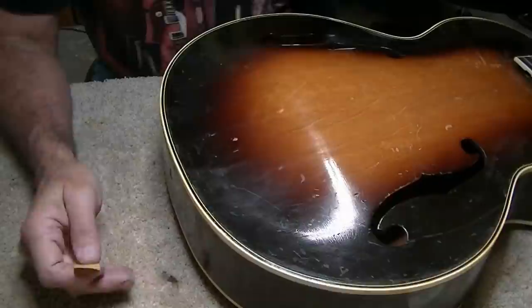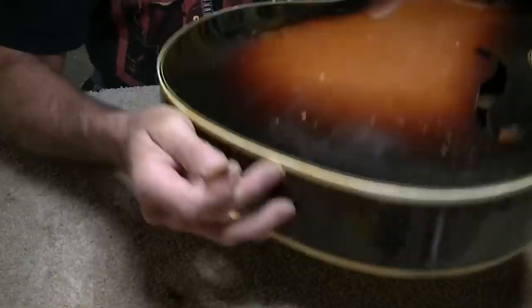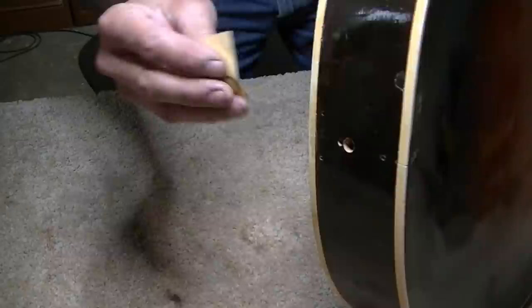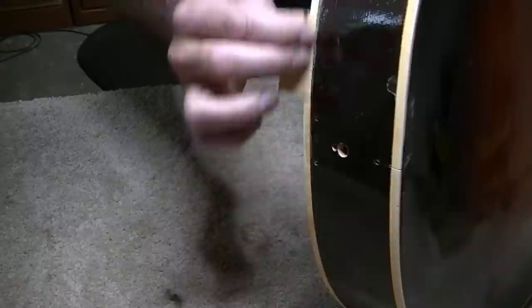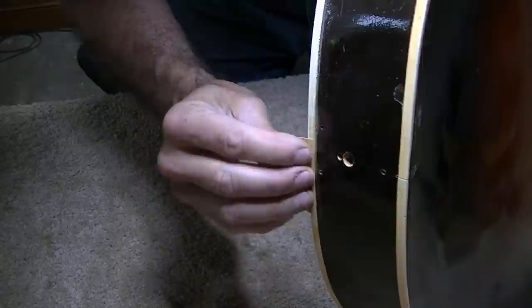It's starting to look better already. As you go through these processes sometimes you find you're close but haven't hit the nail on the head. I like the color we changed this to — it's really good — but unfortunately it also shows up every flaw in the binding. Because we put this color on here it shows up every scratch and scrape mark. So I'm going to sand it all perfectly smooth and do the process again, because it just doesn't look as good as it could.